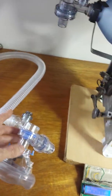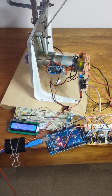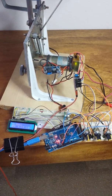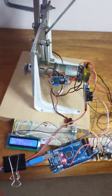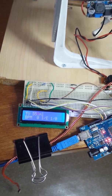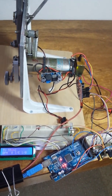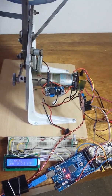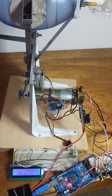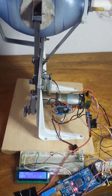So anyway, guys, I'll put the code up once I'm all done with it. Like I said, I still need a pressure sensor input and a volume meter, I would like. And hook up the rest of the LCD for the indications of all the required parameters. And also for breathing assist, that would be done with differential pressure sensing at the mouth. If somebody tries to take a breath, it will actually initiate its cycle on that.